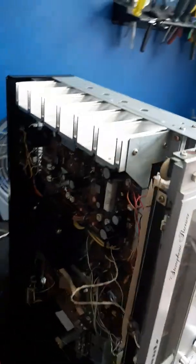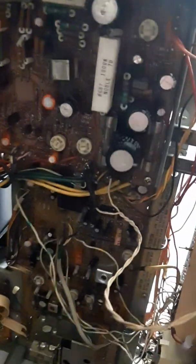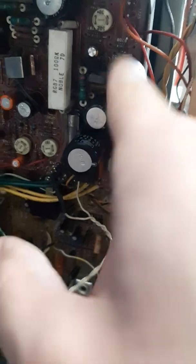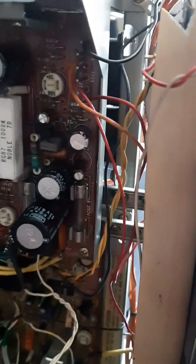This came from another repair shop where they said they changed a lot of capacitors. I wanted to document that I do see this one was changed here, this one, and this third one here — I didn't notice any other ones. I didn't realize these were changed at first because they're black, and specifically this one with the silver stripe — they just weren't that easy to find.